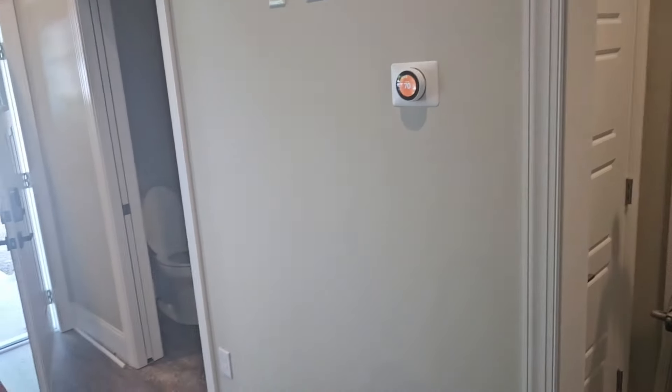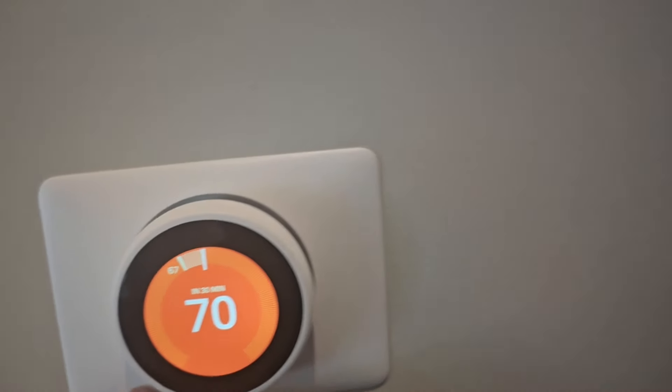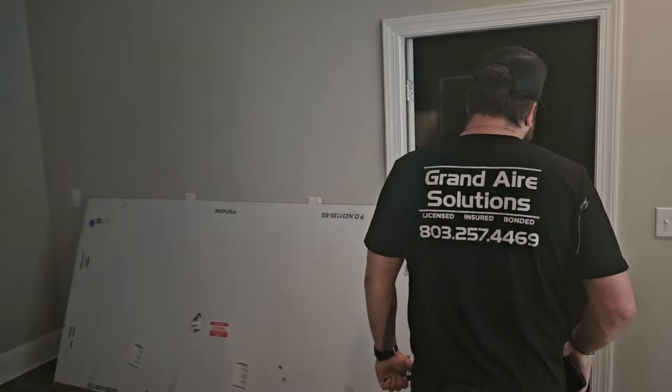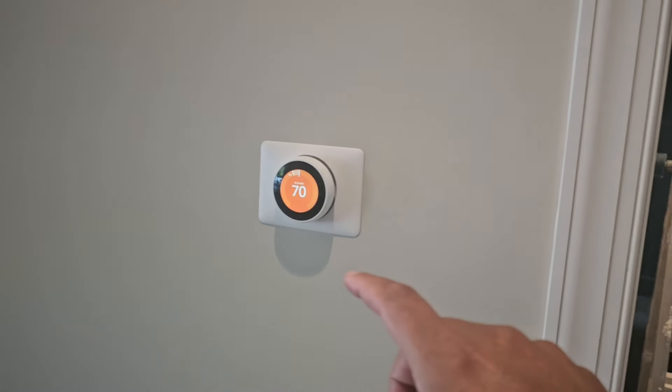The system's running already — it's probably in a delay, we just got power onto it, so that's what I'm hoping at least. This is a brand new fresh construction build. We just put this filter grill in, Jacob just put the Nest thermostat on the wall, and we calibrated it for the heat pump that it is. It's an ICP unit and the reversing valve is wired as O.